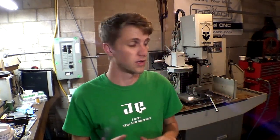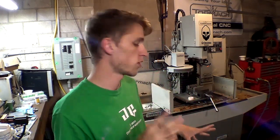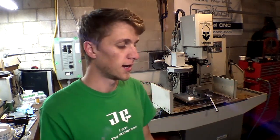Hello and welcome to another fantastically interesting video from the Grimsmo Knives Workshop. This week I want to talk about filtering coolant. On my Tormach and all CNC machines, coolant is used to cool the cutting tool and the workpiece, lubricate the cutting tool, and more importantly evacuate chips from the cutting edge — because you don't want to recut chips, so you want to blast them away with tons of coolant. Recutting chips is a bad thing.